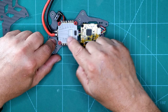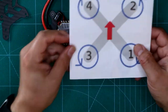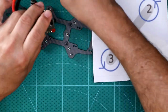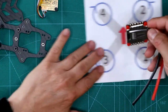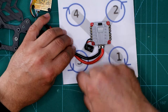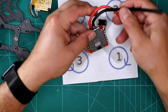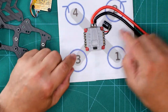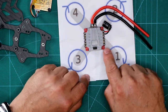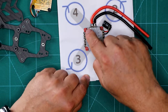Very, very important: if you are going to turn this as I have — turned it all the way around — here's a little chart of the motors. Originally this was set up like this with motor one, two, three, and four. But I turned it this way, so I have to go into Betaflight and remap these motors. So this is one, this is two, this is three, and this is four.